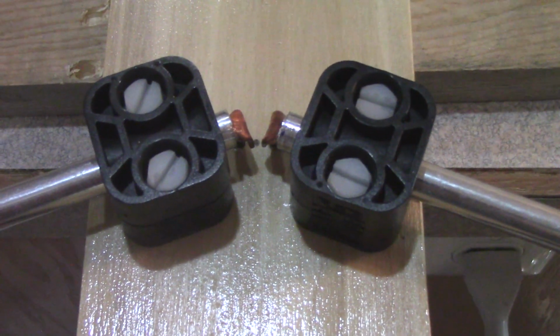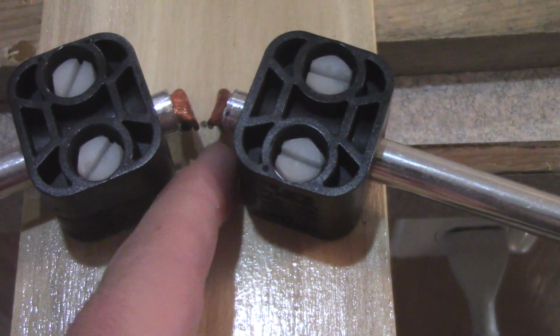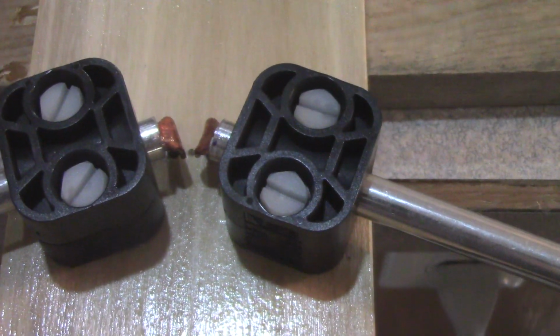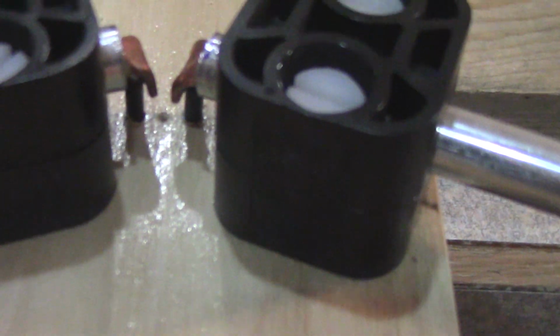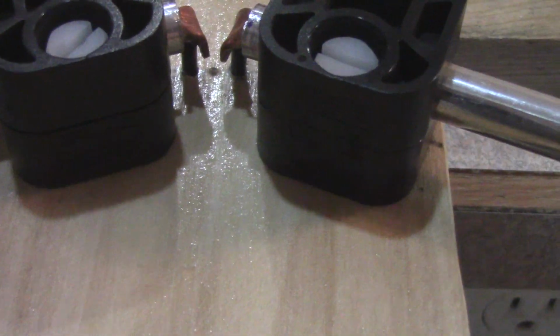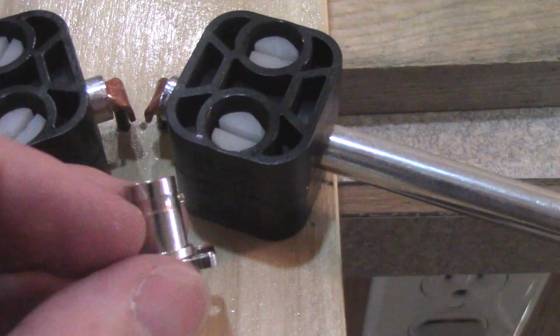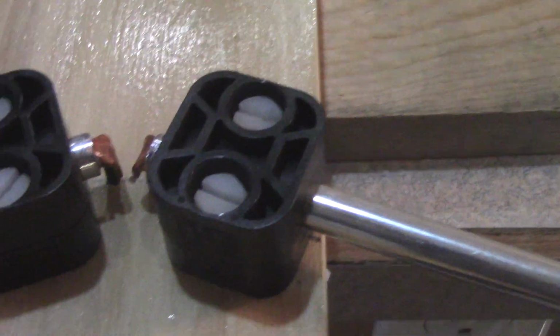Okay, and here is the final feed point assembly. You want to try to keep this about 1/8 or 1/4 inch apart at the feed point, and then I have wires that run down and underneath, and those will hook up to the BNC socket, so that'll be mounted like that underneath here.